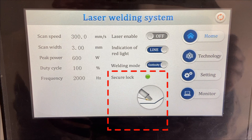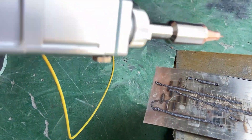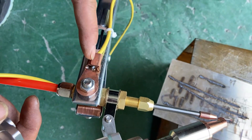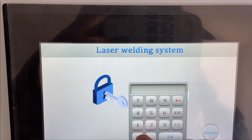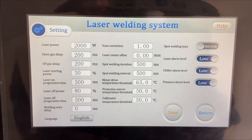If it's a gray dot, it means there is no laser beam emitting and welding is not possible. Sometimes we can also put the clip onto the wire holder — it will keep the loop enclosed, and there is no need to clamp the clip to the target metal plate. But there will also be some risk there. If the welding is not fine, we can repeat and adjust the parameters to get a better result.